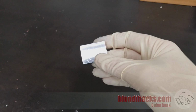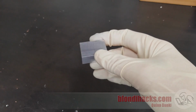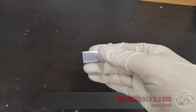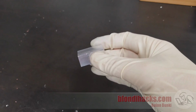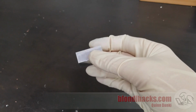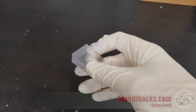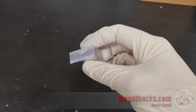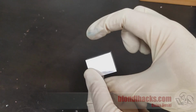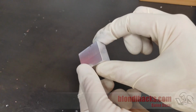Now you may have noticed that all of this time we never said anything about dimensions, and that was kind of intentional, but now presumably our stock is square but larger than the axis aligned bounding box of our part that is now hiding in there. To quote Michelangelo or Da Vinci, or I don't know, one of those dead guys, we just have to now remove everything that doesn't look like an elephant. So the next thing you'll generally do is bring everything down to the final dimension of the outermost features of the part, and then proceed from there.